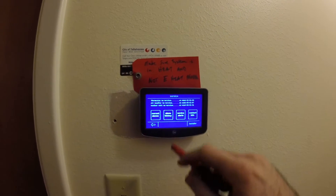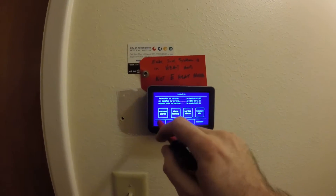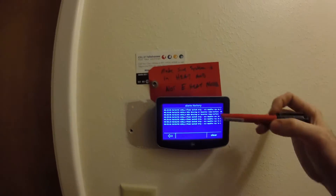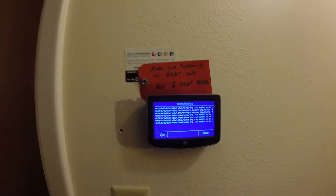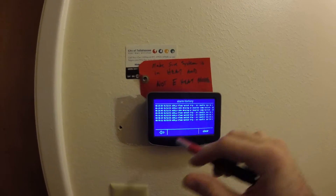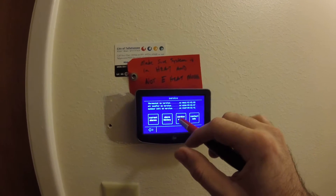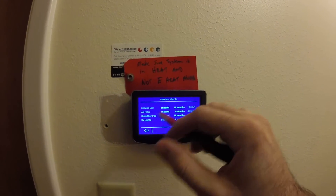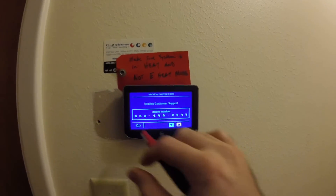Service — we can go on this menu and we can see any current alarms. No current alarms. We can see an alarm history. One neat feature is that you can actually tell it — it's got a special set of contacts for a flow switch or for a freeze stat, and you can tell it what that is, and it comes up right here in the fault history. And see here, service alerts: every 12 months it's going to say service it, air filter every 6 months. That's contact info — we've got our phone number.